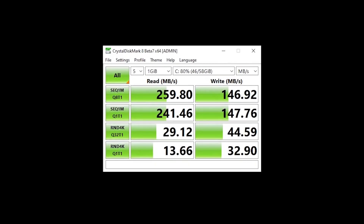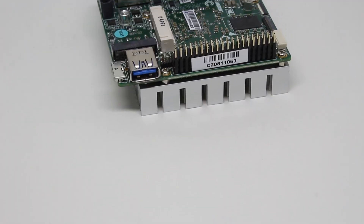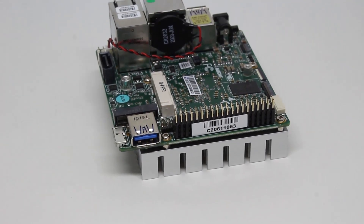It comes in different combinations, all using the Apollo Lake series of chips. You can get a dual-core Celeron with 2GB of memory and 32GB of internal storage for $149, and that goes up to $339 for a quad-core Pentium with 8GB of memory and 128GB of internal storage. I'd say 4GB as a minimum — the 8GB model, which I was fortunately able to test, is nice. And because you can use it with SATA and dual gigabit ethernet, there are some really interesting projects you can do on this in Windows or Linux, making it a quiet, passively cooled board for all kinds of different ideas.